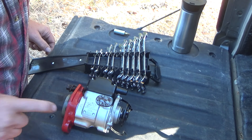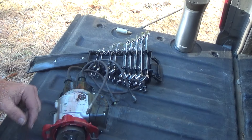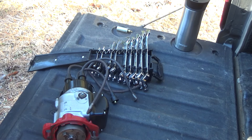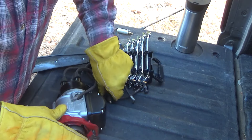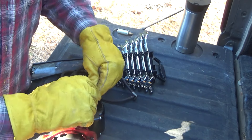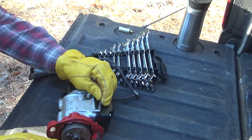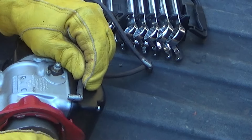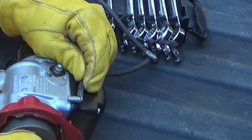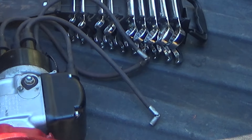Alright, I'm going to get the cap and we'll test this right here. I'm just going to hold this here — I guess it would help if I plugged in the coil. I don't remember exactly where the rotor is positioned. Within four turns, we should see a spark. Okay, that was a good one. It jumped through the paint nice and blue.